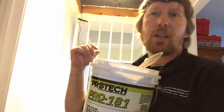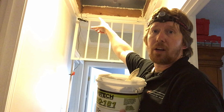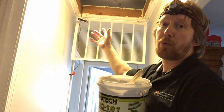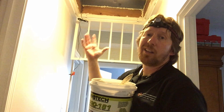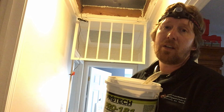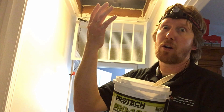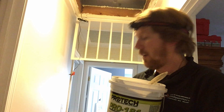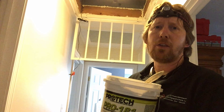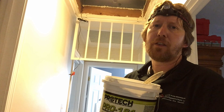What I did was I used the spray foam to fill in the big gaps, as you can see across there. I'm letting it set up for a minute. The nice thing about spray foam is if you overspray it, like right here for example, let it dry and you can cut it off — it trims off real nice. Just make sure you wear gloves. Spray foam is hard to get off, especially if you have hairy arms. Obviously you don't want to drop any on the carpet. You could also do the same thing with caulk, but spray foam tends to fill the gaps a little better.